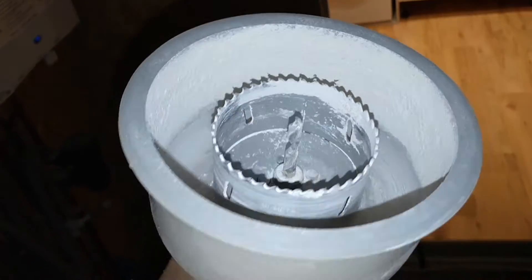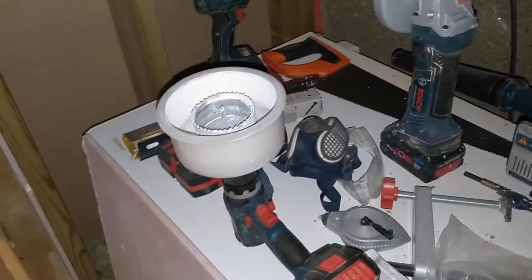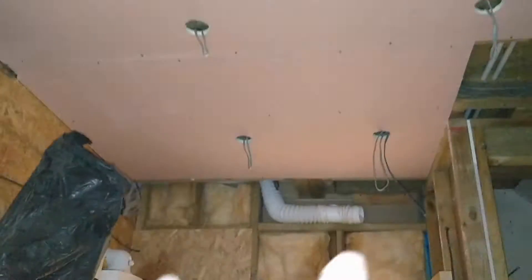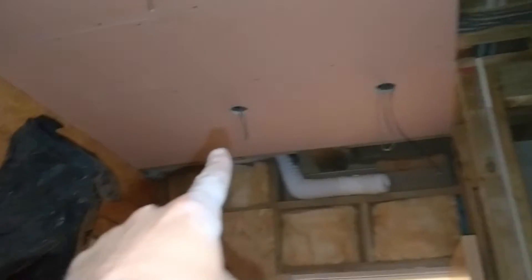Going through, marking up, drilling the holes — I've got four more to do along here and then I'm done, so it's actually a really quick job. This is brilliant. I know everyone's seen these now — the DADE, the Dust and Dirt Eliminator. It's just so good, especially with plasterboard dust and lath and plaster dust — just excellent. Very happy with that. These are the two first lights here and then they step back a bit as you come into the room and the room widens up. These ones possibly could have been a bit further over but I wanted this to be in line the whole way along.